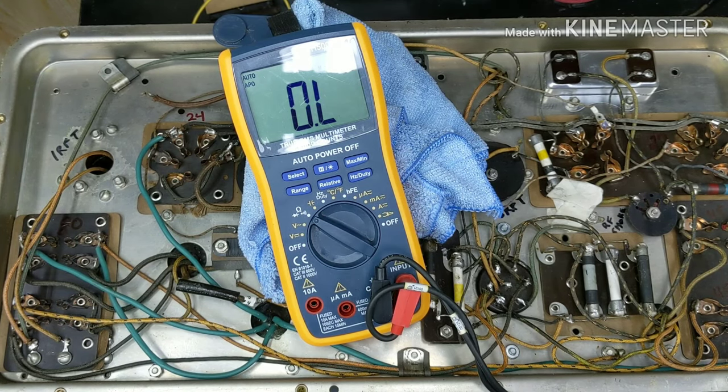It appears both the output transformer and the input transformer are both good. So that puts pressure on me — when I take this quality condenser out I've got to melt that out and be extremely careful so I don't screw these coils up. That'll be the next step: mark these wires and get this coil off of here.